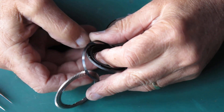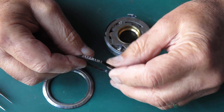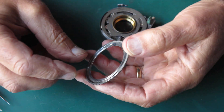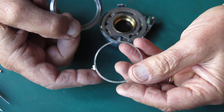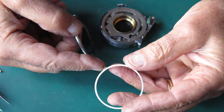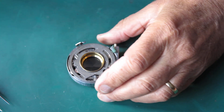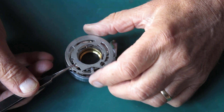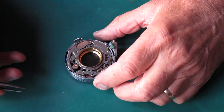Remove the front rings - there's the lens mount. This is the piece with the aperture numbers on it; it telegraphs the numbers to the top of the shutter where you can see them. This is the coupling from the settings ring through to the aperture setting and the shutter speed settings ring at the front. And the shutter speed settings cam plate, and we're into the shutter itself.